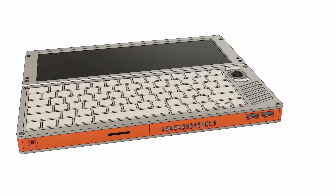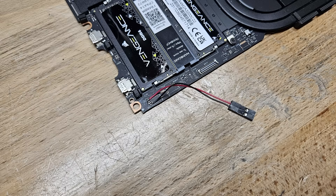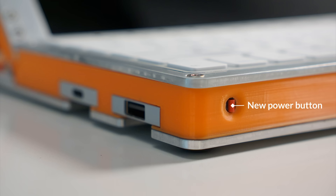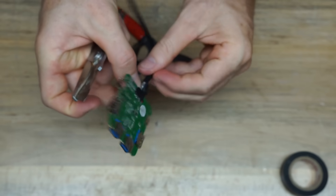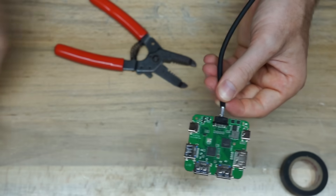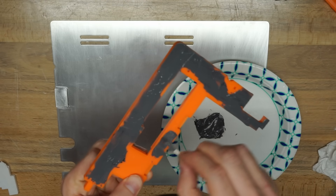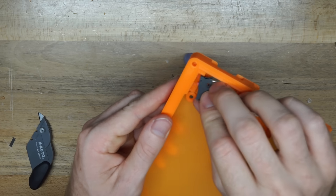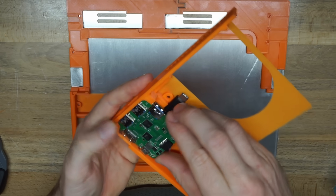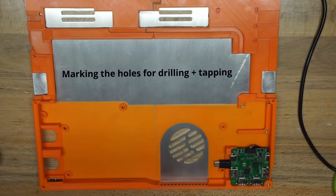There were a couple of minor issues. Because of the keyboard placement, I couldn't directly access the power button on the main board, so I soldered on wires and made a plug to connect to an external switch — being able to actually turn on the computer always helps. I also had to cut the outer rubber sheath off of the USB-C hub and video cables since they were too stiff to bend into the right positions. I carefully used a razor blade to remove them, then wrapped the cables in black electrical tape. I then used JB Weld to hold the 3D printed parts to the aluminum plate and glued in the power button, header pins, and keyboard.